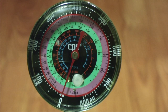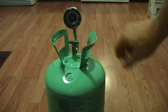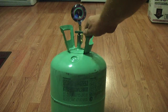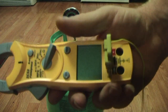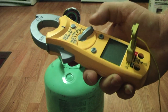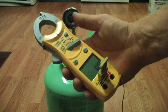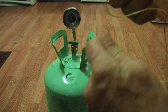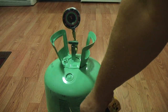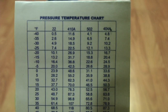Only a few tools that you need. First thing you're going to need is a tank of Freon. Second thing you're going to need is something that's going to measure temperature — I'm going to use my little field piece here. It's got a little K-type probe on there so I can measure it. I'm going to actually tape this to the tank. The next thing you're going to need is a pressure temperature chart.